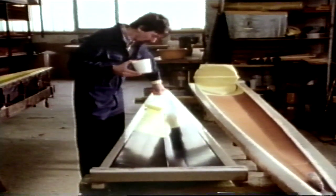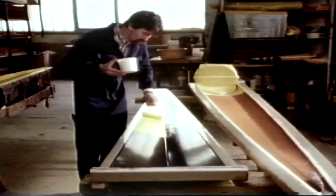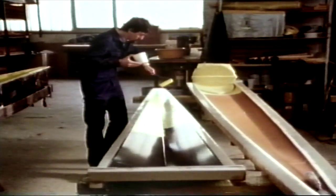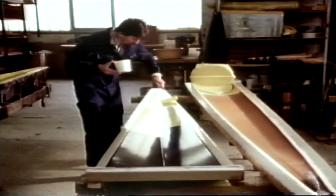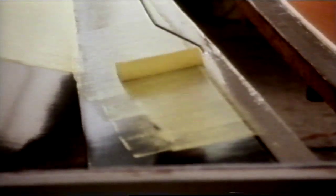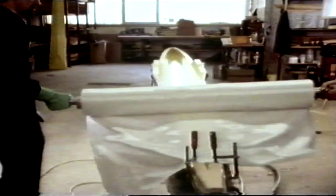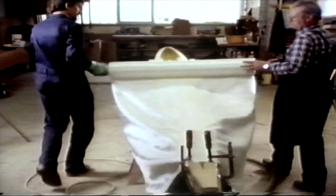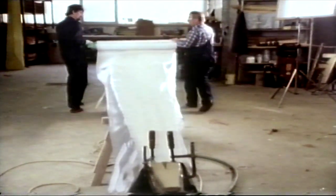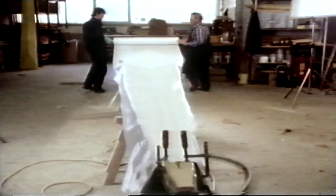In the construction of plastic shells, the hull and deck are made on the inside of a mould. This mould is first coated with a separator and then with gel coat, the yellow outer layer that is typical for Empacher boats. The system for building the hull is a sandwich construction. On the inside of the gel coat is a layer of fibreglass that is attached with an epoxy resin.